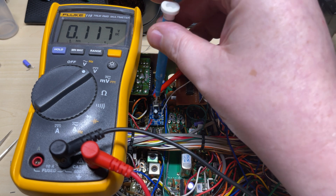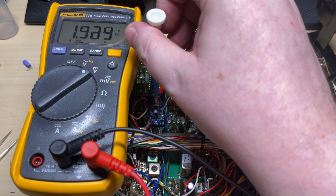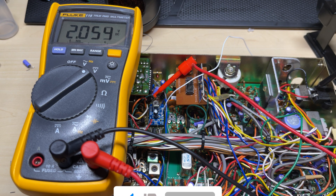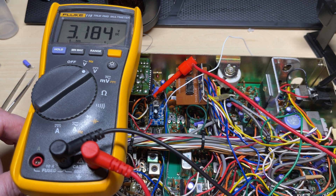At this point, we can test the VCO. This VCO comes pre-tested, so it should just work straight away. Connect your multimeter to the test point of the radio and check the VCO lock voltage across all your bands. If necessary, adjust with a non-inductive tool.